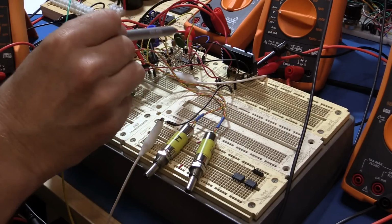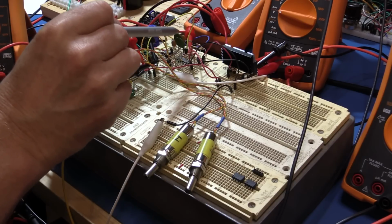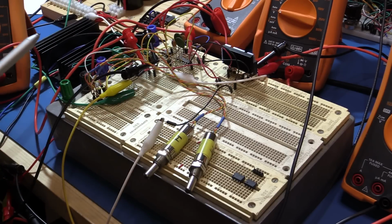These two capacitors here that you can see sitting here right now, these are the two that I added into the circuit, and we'll describe that in a moment. What I want to do is show you what the performance is like now of the transient response time when I change the loads, and you can see for yourself. It quite happily now will track from 0 to 30 volts because I've got plenty of high side volts to power this.